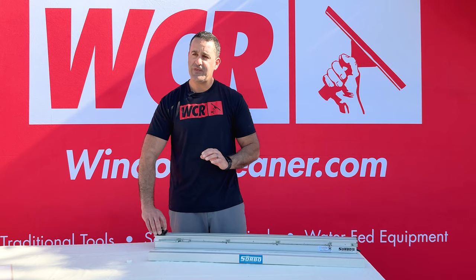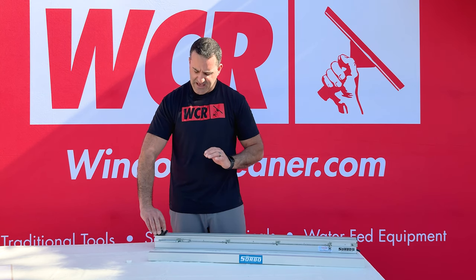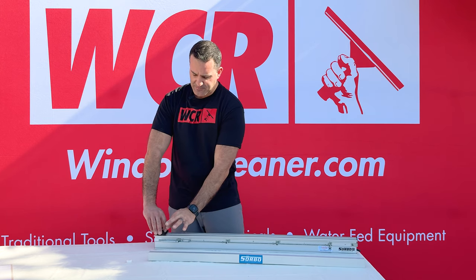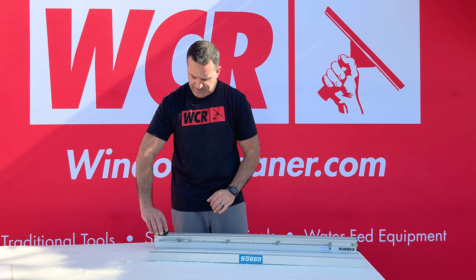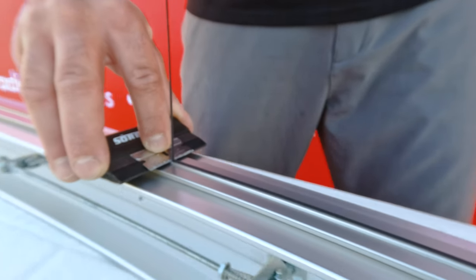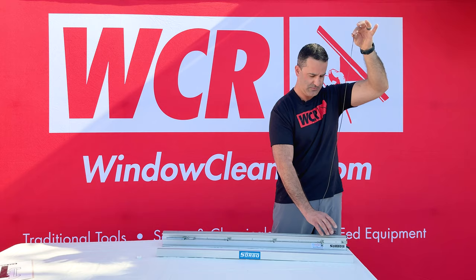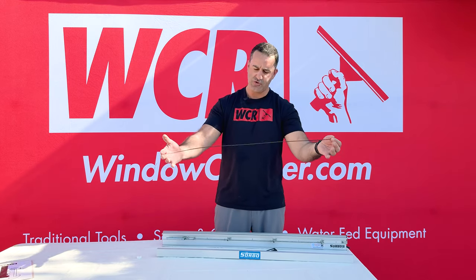Before you start to cut, it's important to know that you have to move consistently and fluidly across — you don't want to stop, speed up, or slow down; you want one consistent speed across. As you start, you'll get a little bit of rubber curl on your fingertip. Grab that rubber gently and pull it straight up, keeping tension on the rubber. Start going, get that little piece, and then at one steady pace while pulling the squeegee rubber right up, go all the way to the end — and just like that you have a fresh cut piece of rubber to discard.